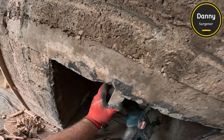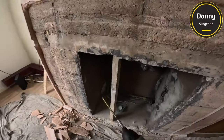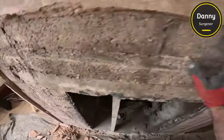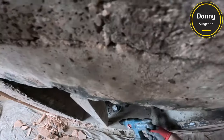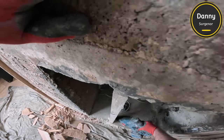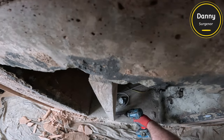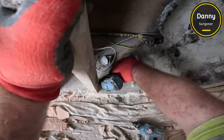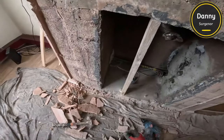I fix it from the bottom and then move up and fix it at an angle into the top, making sure it's flush with the edge of the concrete. Then I just bang another one of those concrete screws in, and because it's self-tapping we don't have to worry about wall plugs. We just drive it straight in.